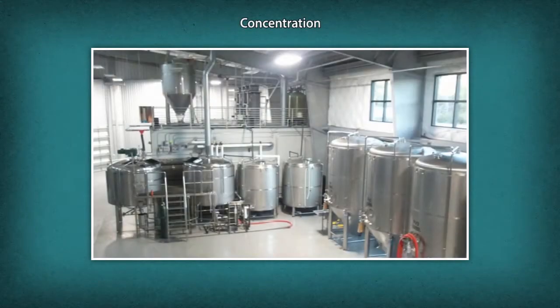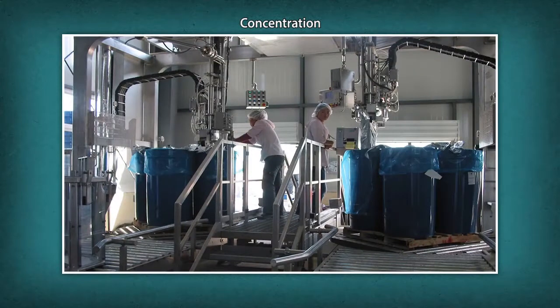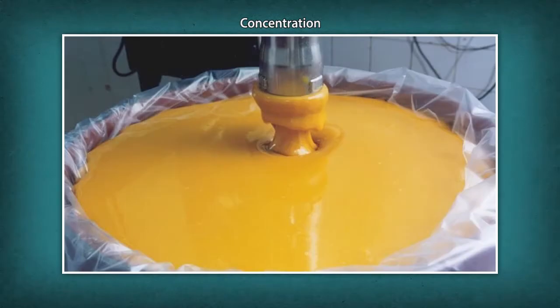Concentration is a process to cook fruit pulp in order to remove water content from the product. The fruit pulp is boiled and becomes thick after water evaporates — this processed fruit pulp is called concentrate. It is done in an evaporator under controlled conditions of pulp flow, temperature, and boiling time. Low temperature evaporators operate at a maximum temperature of 50 degrees Celsius.